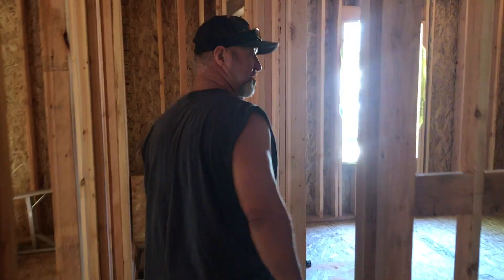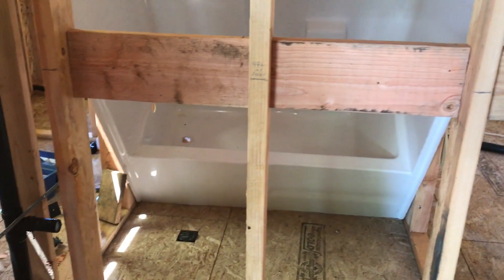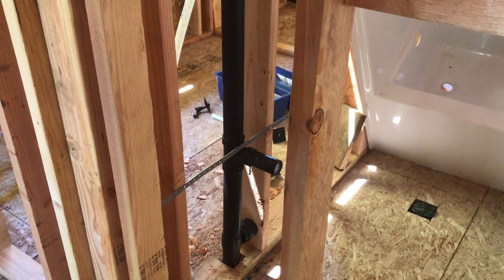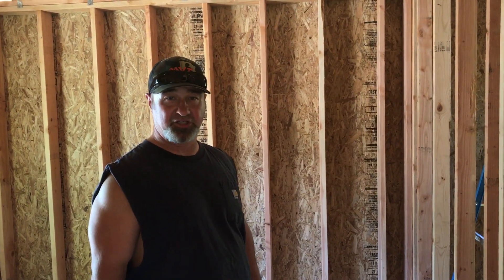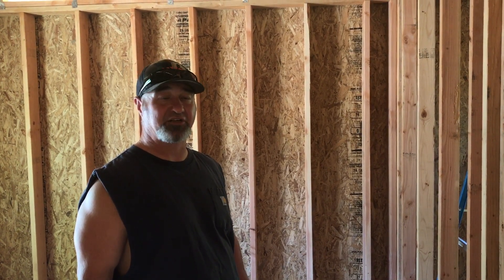You can get a glimpse of the inside of the tub unit as we're cutting off the feet to get it nice and level so it sits straight and level and the water flows directly to the drain. Over here you can see more vent piping and water piping from the water heaters. The vents go completely up through the roof protecting the health of the people inside. Once done, we have another inspection — we fill up the waste and water lines, check for leaks, make sure everything's up to code, then move to finish plumbing after drywall, cabinets, and electrical are done.